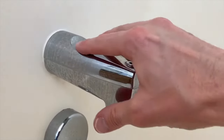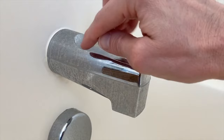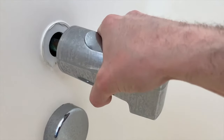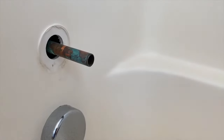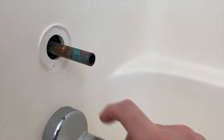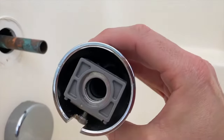Just loosen it. This is a press fit faucet and there are no internal threads inside the spout. All I'm going to do is carefully pull it out. As you can see, there is also no thread on the copper pipe that feeds water into the spout. From here, let's head to the workstation.